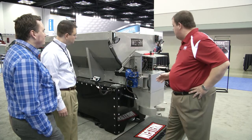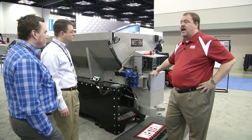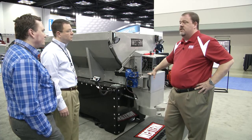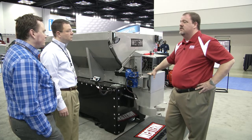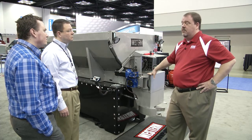We also offer multiple motor types, though not always in the same size. For example, the 7-foot 1.5 cubic yard unit only has our electric option, but we also have a Briggs & Stratton gas, a Honda gas, and on our two larger units — the 9-foot and 10-foot — we have a dual hydraulic option as well, because those tend to be put on central hydraulic trucks that require extra strength to get material moving.